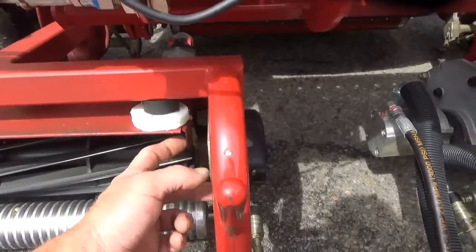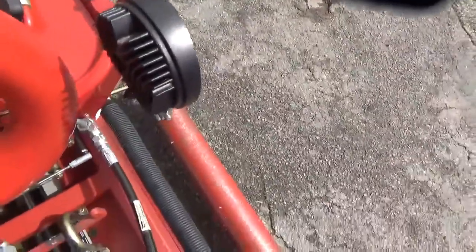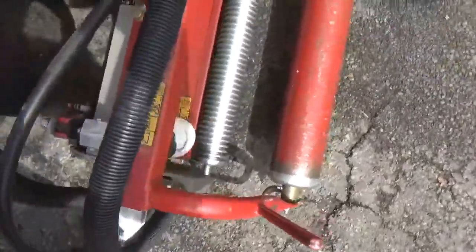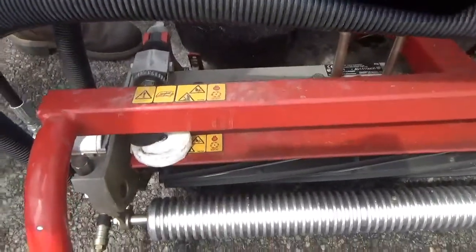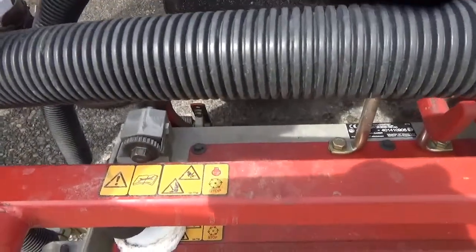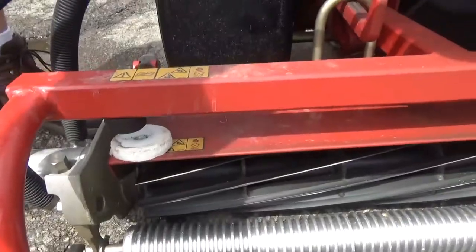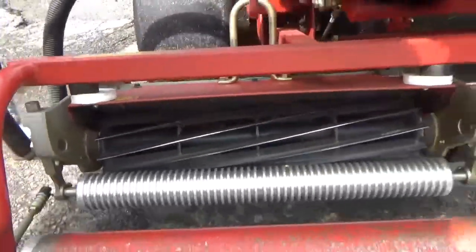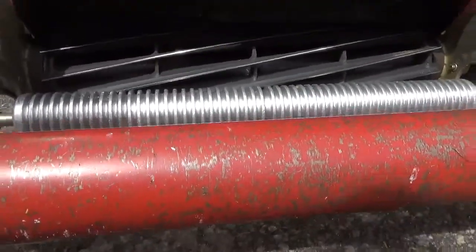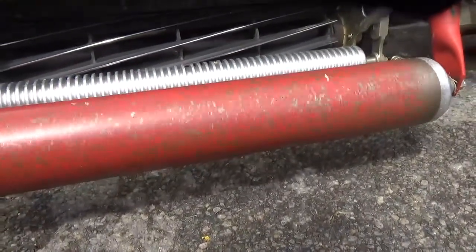Let me show you how I made these discs and what we're going to do to the reels to stiffen them up on the plate. When the reel gets lifted, that extra shim in there picks it up and you get a little more distance between your front roller and the ground. What happens when the tires are bouncing is it dips down the front and punches the ground. I don't like fixing these things more than I have to, so that's why I did this.